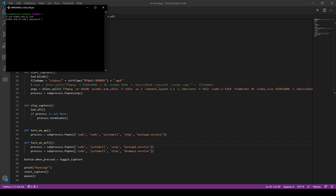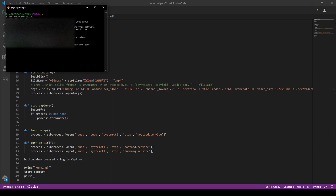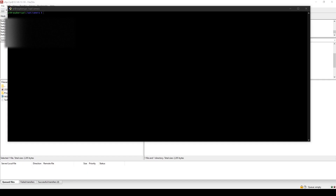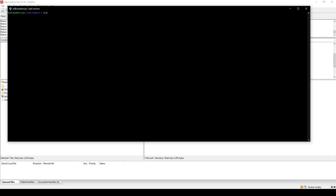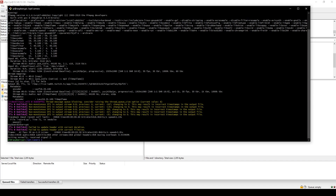For this week's video, I'll be mostly focusing on getting the initial setup and doing some basic proof of concepts. I'll be utilizing FFmpeg for the video conversion — actually taking the video off of the USB camera and saving it on disk, as well as for streaming, which I did get set up and working. That will be the basic backbone of the system. I also plan on implementing other tools and features down the line, but for now I'll be sticking with FFmpeg and simple GPIO pins to control it all.